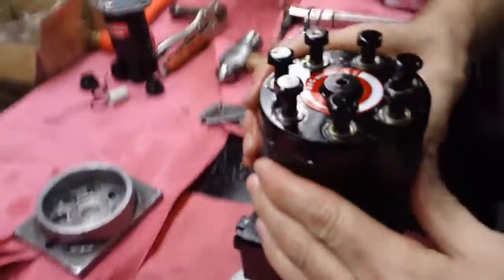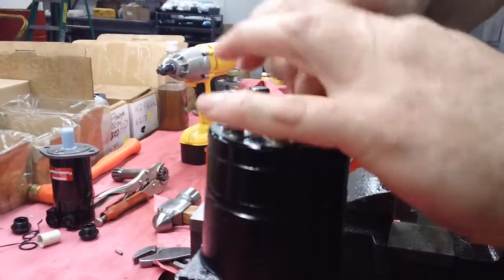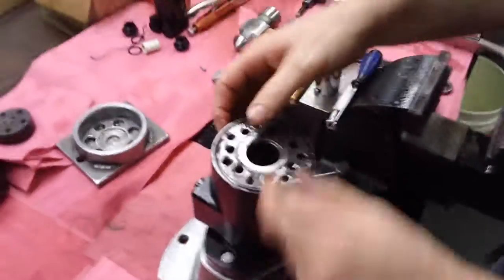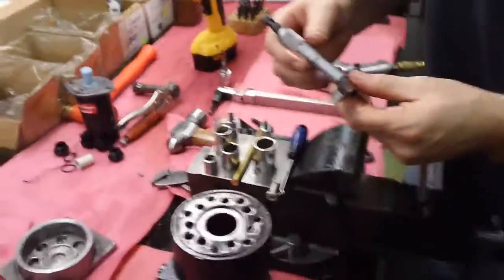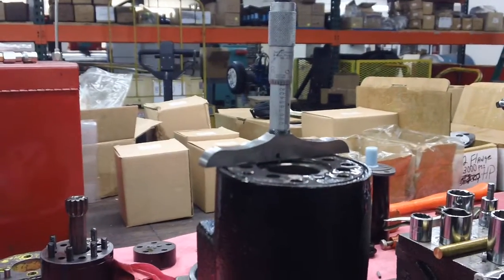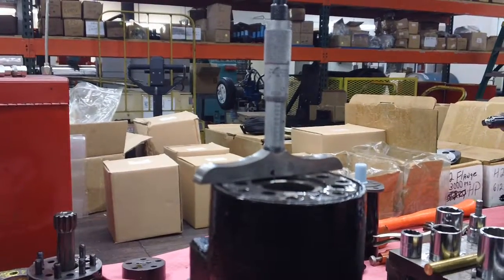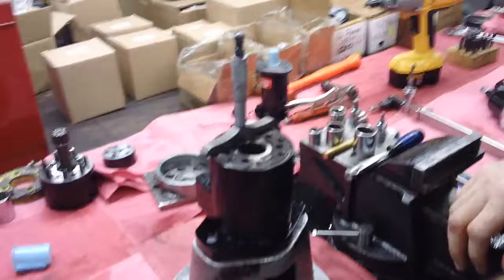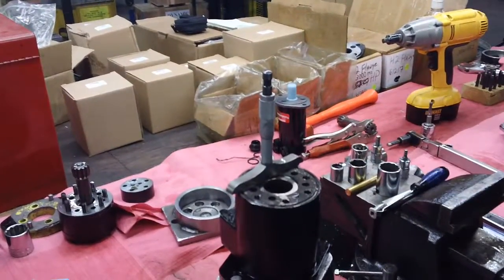Take the whole rotating group off. You have to take your O-ring off. Then you're going to take a depth mic — measure to a thousandth of an inch. There's a formula: take that thousandth-of-an-inch measurement, multiply by 25.4, then subtract your tolerance of 0.3. I have a cheat sheet here. That'll give you your measurement for your spacer — you're converting from inches to millimeters.